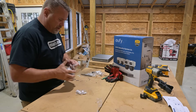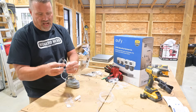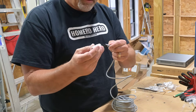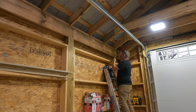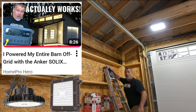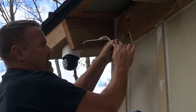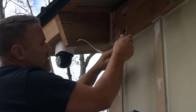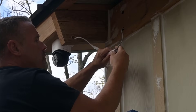For the Ethernet cables, get the waterproofing kit out. It's real simple — got this little white gasket with a cut in it. Slide it on the wire, then this slides right on through. We'll fish it through the wall. Make the connection, screw this on — it's all plug and play. That little white gasket slides right in, then this goes over the top of that and tightens it all up. Nice and waterproof.